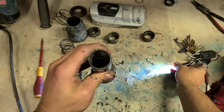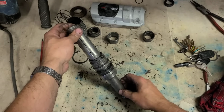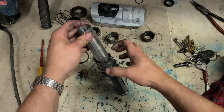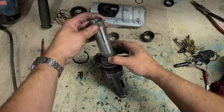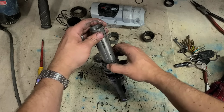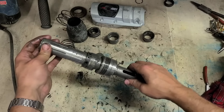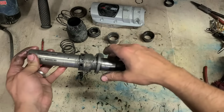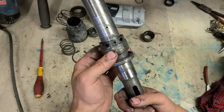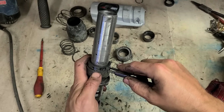Well, that was probably jammed in place. So over the top of that striker bolt, there'll be a steel ring connected onto this plastic piece with a few steel pins. So that should slide up and down. That's not moving. So that's our actual problem. It's nothing to do with the striker itself. If we can salvage this thing.